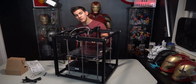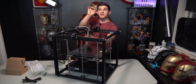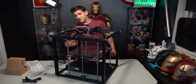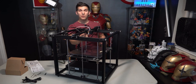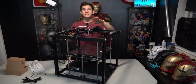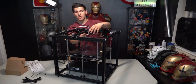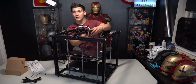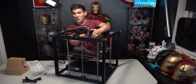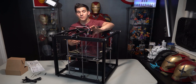So what you're gonna wanna look for is underneath it, you have the three wheels, the two on the top and the one on the back. The one on the back actually has a washer nut on it that has some flat sides. And it just so happens your little double-ended wrench here, the large part, fits perfectly on that nut that's on the bottom roller wheel. This is called your eccentric nut, and there's a couple of these scattered around the printer. As you rotate this, this whole assembly is gonna get a lot looser, or as you rotate it the other way, it's gonna get tighter. So you're gonna wanna wobble it back and forth while tightening it until it doesn't wobble anymore. You wanna get it to just that point, but no tighter, because you don't wanna over tighten it, because you still want this to move nice and free, but you don't want it to wobble.